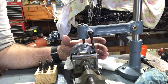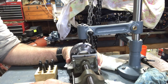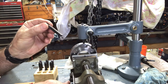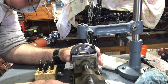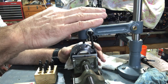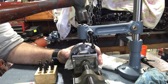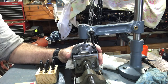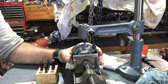The next day I'm numbering the hand wheel. I'm using my pillar tool, lining up the numbering stamps by hand and eye - that's the way I'm most comfortable. The little knurling indentations I made yesterday serve as a good little bracket for where the numbers go. I carefully line it up, put a little pressure on to make sure the stamp will hit level, then just tap it. I'll repeat this all the way around - it's quite a laborious process, but having fun using the pillar tool.